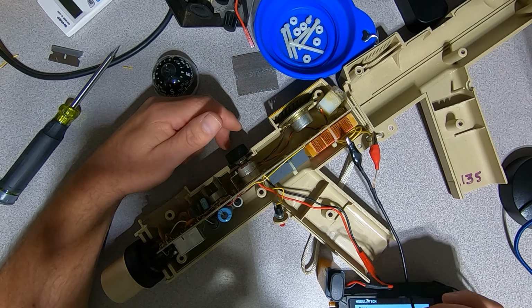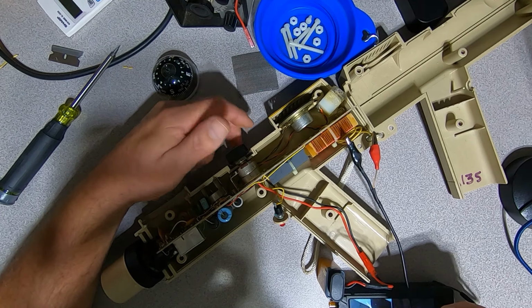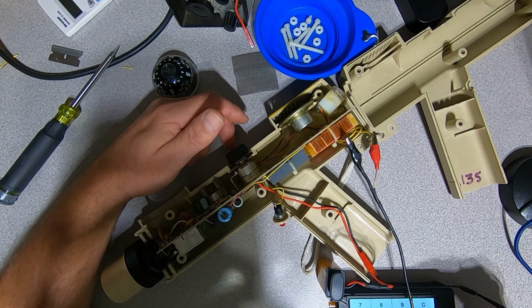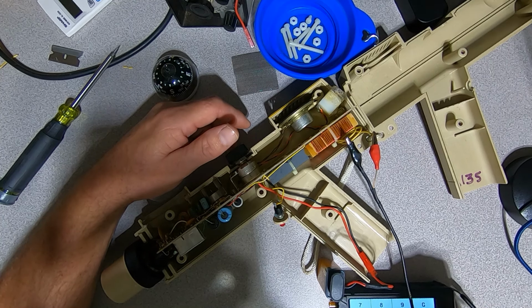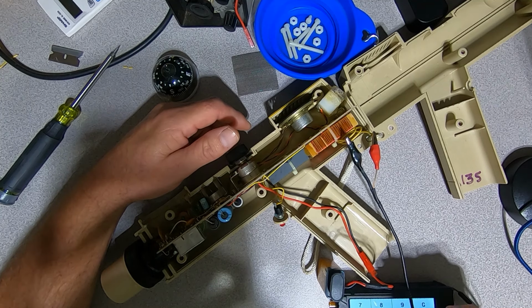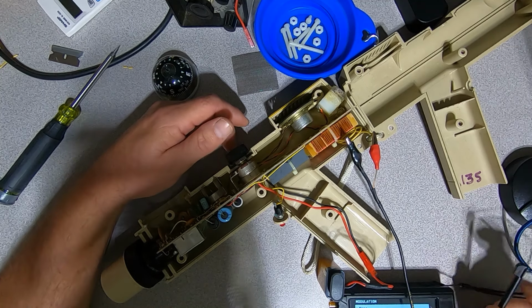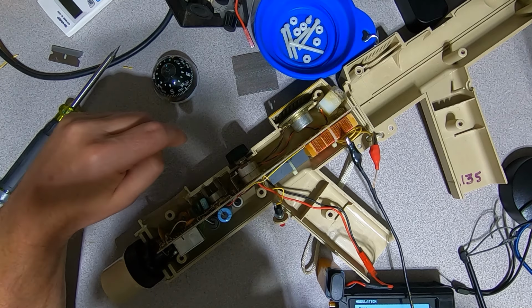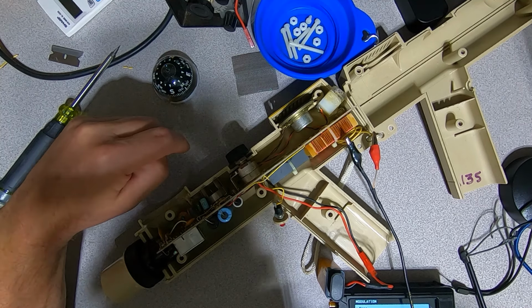Now let's go and apply 1020 hertz. Now let's go ahead and try 2 kilohertz. Yep, still got audio. Let's try 3 kilohertz. Let's try 500 hertz. And back to our carrier. So I'm going to go out on a limb here and say that the audio filtering portion of this design is not in the production models of this.